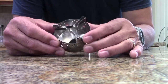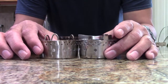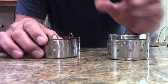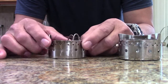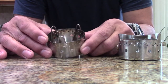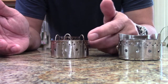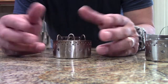One of the ideas we're working with — and again these are just prototype ideas right now. What we've done is get rid of all this upper half. It's a cool-looking design, it just takes a lot of work. I've welded in these steel pins, three in a spot, to act as pot stands, and we'll fire that up — it actually looks pretty good. It's still in the experimental stage; once I get through this I have to see if I took the labor content out, and then I've got to go test it out in the mountains, at ten thousand feet.